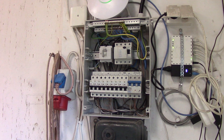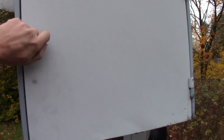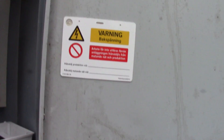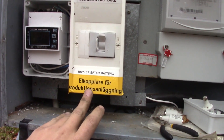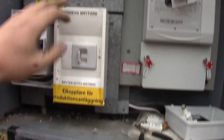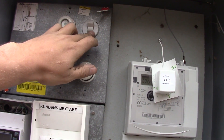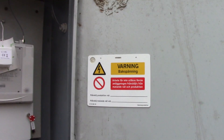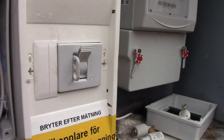Those fuses are just tied directly to the rest of the grid. That's basically it when you have a grid-tie inverter — there is nothing really special, especially not in Sweden. The only thing you need to do is make sure you have the breaker, and on the main box outside you need to make sure you have the proper power stickers. This is the main cabinet for incoming power. What's needed is that marking indicating that if you break this you won't have any power going inwards. The reason I'm not using the original one is because that one cannot be locked — you need to be able to lock it. So that's basically it: that sign, that sign, and my lockable switch.